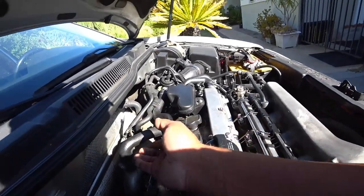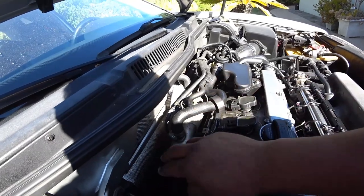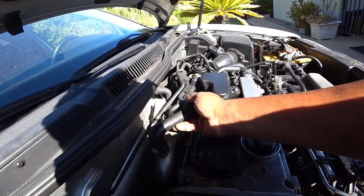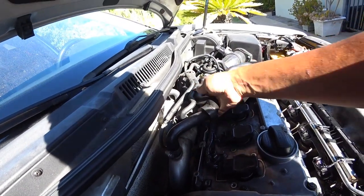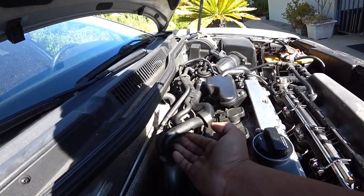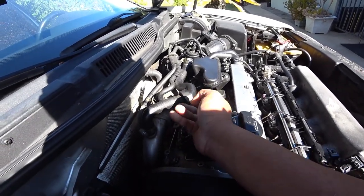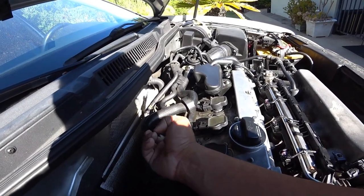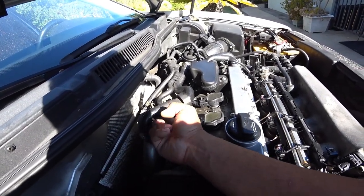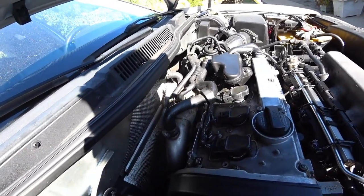Right here on top of the discharge pipe, these hoses have to be very thoroughly inspected to make sure they're not torn in any way. Put your hand underneath here because they're notorious for blowing right here where my finger is underneath, because the turbo manifold sits right below it so this gets really, really hot. Eventually these will get brittle and crack open right at the bottom and you won't know unless you're looking for it.